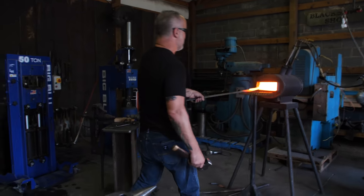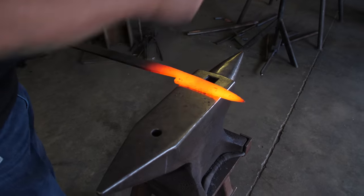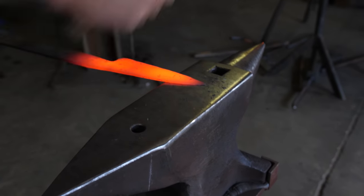That is our setup for our preform and taper. I started to set the spine because it's a chef's knife and I really want to set that thickness. Now I'll pull the edge down and work it up into a very classic French chef style knife. The thinner you go, the faster it heats up — and also the faster you lose heat. So be aware of that. Don't work down into the dark heats yet; that's for planishing later on. What we want right now is to make it shaped, sexy, and sharp, ready to be heat treated. Grinding happens after this.